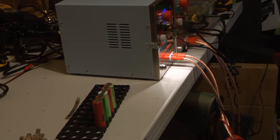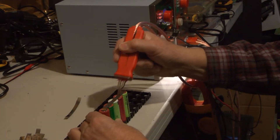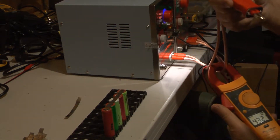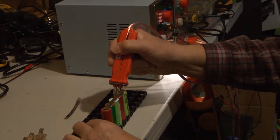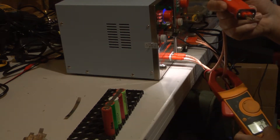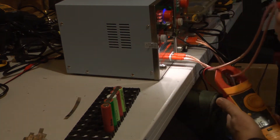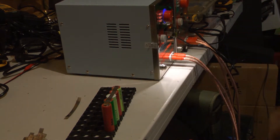The other one was 280-something amps at 120 volts. I'll put it on 10 pulses just for fun — that gives 432 amps. Let's see what happens all the way up; it'll probably burn a hole in the top of the cell. At 18 pulses: 467 to 468 amps. That is way too much power for these cells — I'd probably burn a hole in the top.